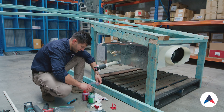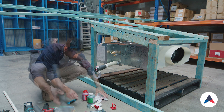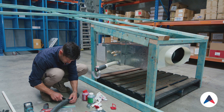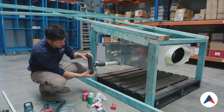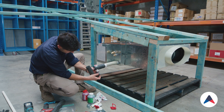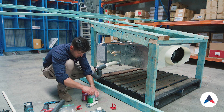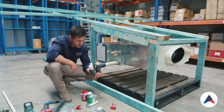We're going to glue the next part of the trap. As we go, we will insulate and glue, insulate and keep going. We want to make sure everything is perfectly sealed and completely insulated so we don't get any condensation and water leaks. We'll prime up and glue the next piece with that seal.